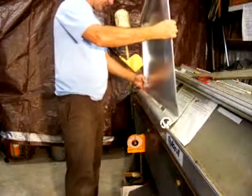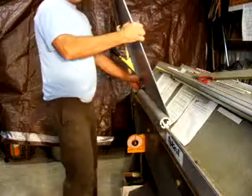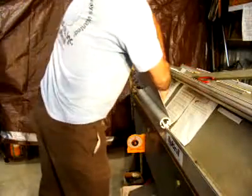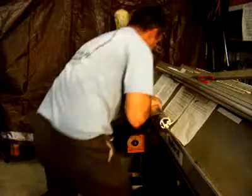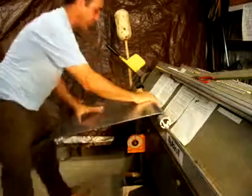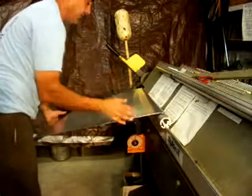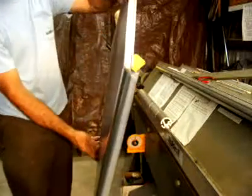Insert the single flange into the multi-roll single slot. Tension on it, hold it around the back side. Pull it around. Slide it for 90 degrees. If it's not enough, push a little more. If it's too much, pull back. Lift up, push it out of the die, and there's your radius.